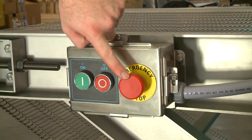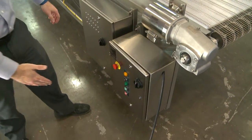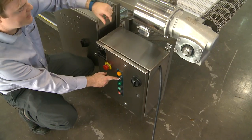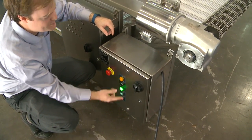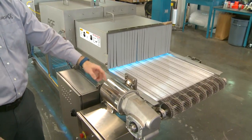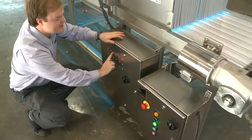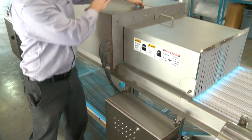Here's that same on/off power box. The main control box is right here where I began. You have an on green button, an off red button, and an interlock open. To energize the system, all you need to do every morning is push the green button. You can see it's automatically going to engage the motor — the conveyor belt will start moving and the lamps are going to turn on at the same time. All the LED indicators are on and glowing green, which means every lamp in this hood section is on.